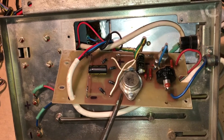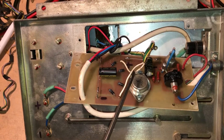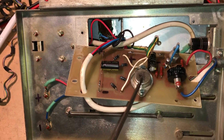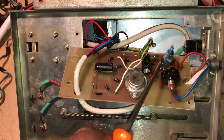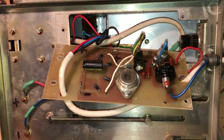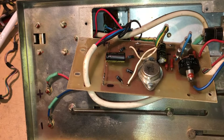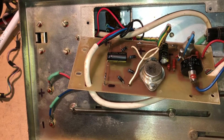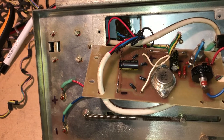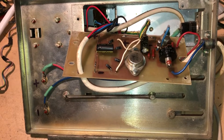Let's go back to the manufacture date of 1980, because the year is important. Budapest Radiotechnic Works still used germanium semiconductors — this ASZ1015 pass transistor here, and this smaller transistor here is also a germanium type. As far as I can remember, one of the biggest semiconductor manufacturers, Motorola, stopped using germanium type semiconductors at the end of the 1960s — maybe 1968 or 1969. But this factory was still using germanium transistors in this power supply in 1980.